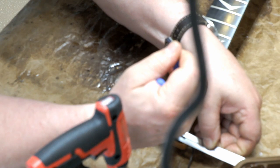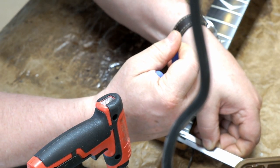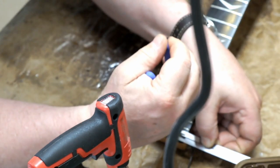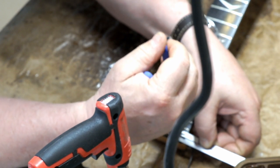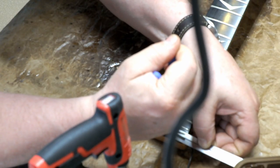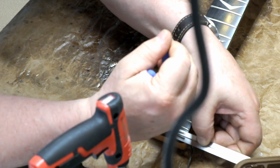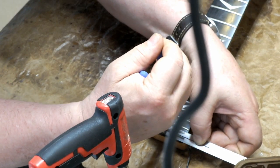one of the things I was concerned about was that you're heating up a fret that's set into plastic. But this is thermoset plastic, and apparently it can withstand temperatures up to 500 degrees, which I didn't think it was going to be getting from the soldering iron I was using indirectly through the fret, but I had to be fairly careful in moving the soldering iron along it to make sure that it would remove the fret.